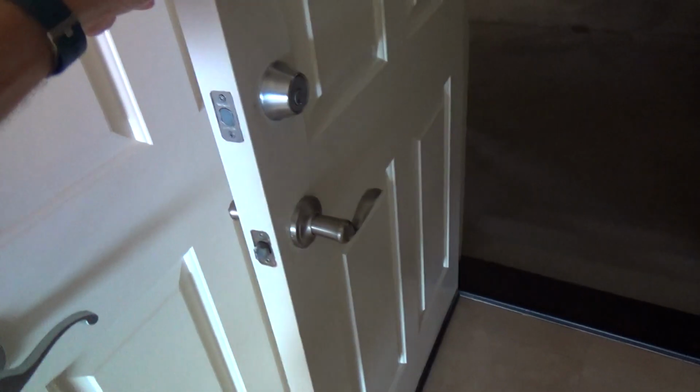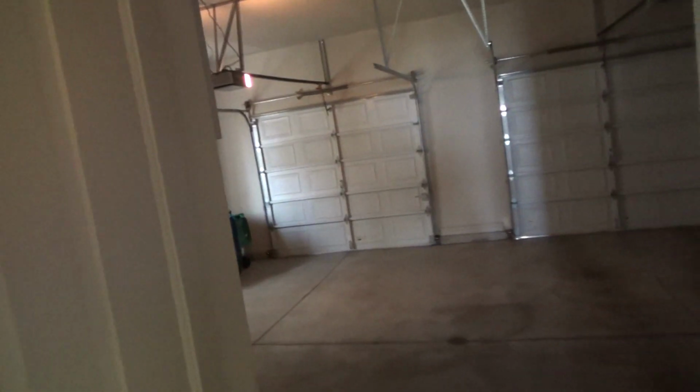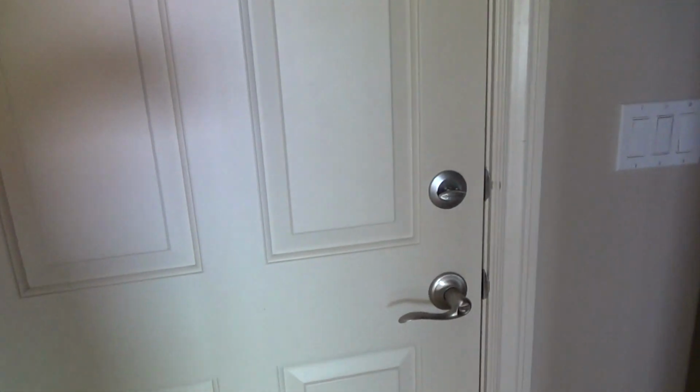But let's open this. Boy, that thing squeaks too. See? That's how your door is supposed to close. And if your door is slamming or something, you can back these springs off, if you know how these spring-loaded hinges work, okay? But make sure that you don't have your garage doors open as you're adjusting this, because you close your garage door and then all of a sudden your doors aren't closing all the way. Maybe you get it to close a little less with the garage door open, and you think, okay, I finally got it. And then you close the doors to your garage, and then all of a sudden you have more air in there that has to push out. You think, oh shoot, now I have to adjust the doors again. This one's kind of slamming. I could lessen those later.